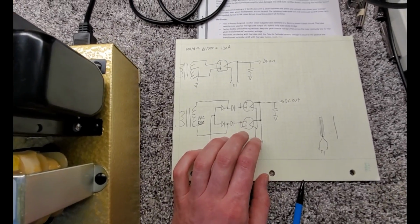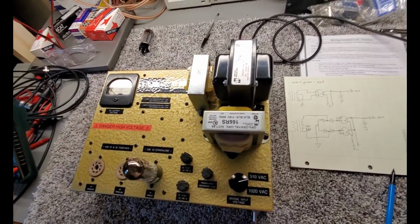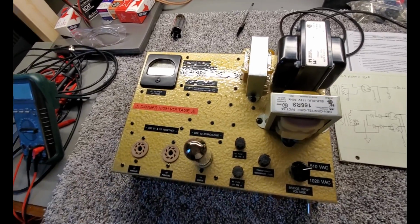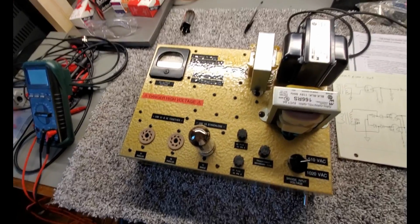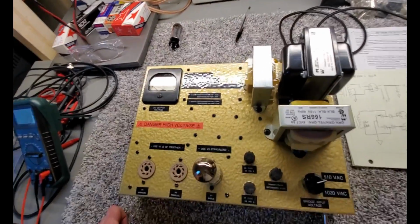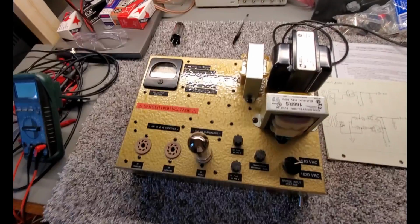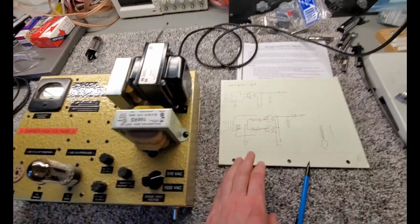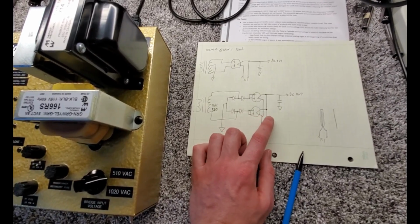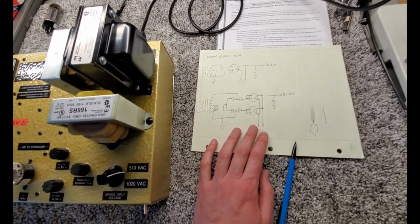So normally, like what we do with 2845 and any of our products that we build, we test them out, we bring them up slowly on a variac first, let everything stabilize and make sure everything's happy before we hard switch the power onto the amp when it's plugged into the wall, as a user would. 2845 with all of these rectifiers is fine in that condition. And so we can bring it up to the full operating voltage with the peak inverse voltage and never have an issue. So it's clear that peak inverse voltage is not the issue with this arcing. Something else is going on.